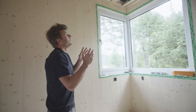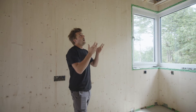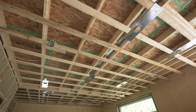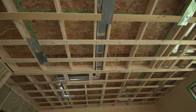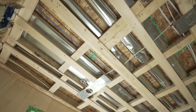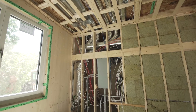Something that is also a challenge within a CLT wall system is our actual HRV unit. If you look at the ceiling, we have a drop ceiling and we're able to run all our HRV through that utility cavity we create — not only the utility for the HRV, but also our plumbing vent and any electrical wiring and pot lights, as you can see across the ceiling.